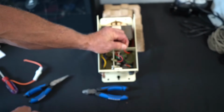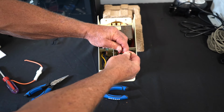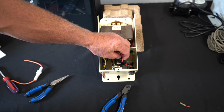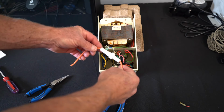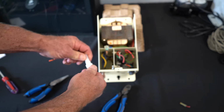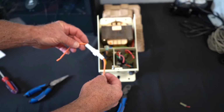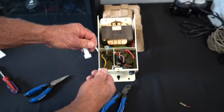Go ahead and grab the wire and get your other wire, and again you're going to want to snip the lug off of that other wire. And then you're going to get yourself a barrel fuse holder. You can get it at any automotive store. Make sure that you get one that is capable of 30 amps. And then you put a 10 amp barrel fuse in it.